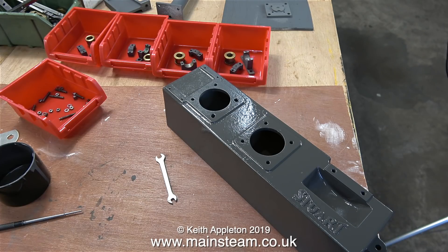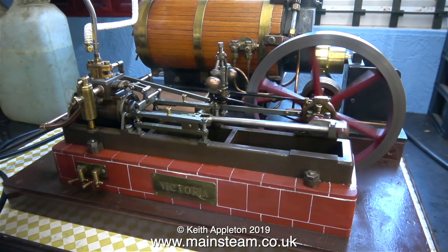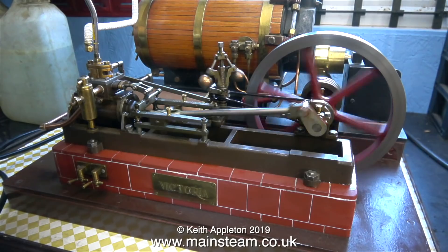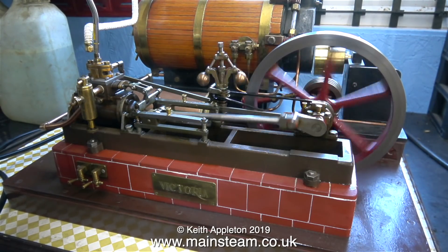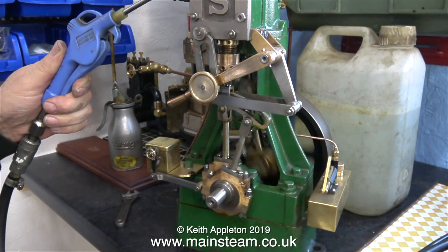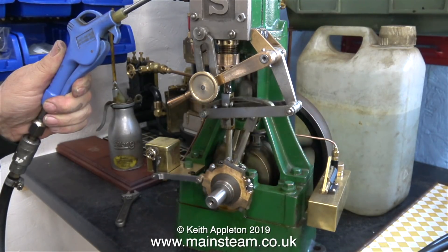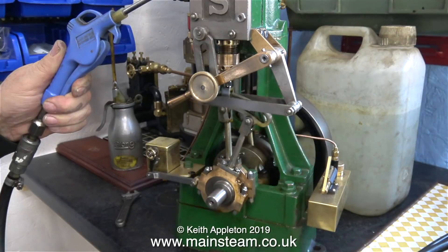What we're going to do next are one or two experiments using slow motion. Steam engines are capable of running very slowly anyway, so the slow motion I really only do to slow the audio down. The slide valve timing of the Stuart Victoria is quite retarded, and that's why the exhaust doesn't chuff very well — it's a very soft beat. At the moment I'm using the camera's super slow motion feature; the only problem is the picture quality is not as good as I normally get. Have a listen to this Stuart 5A — this engine is set for early admission. The valve opens just before top dead centre at each end of the stroke, so you get a short sharp crack of an exhaust beat. I'll turn the sound up so you can have a listen. This is at 20% normal speed but the picture quality is not very good.